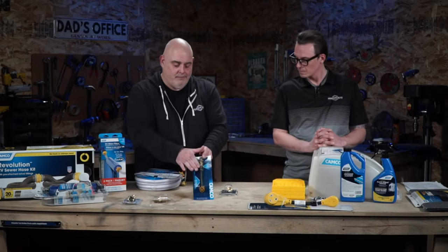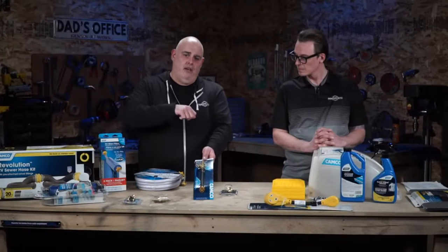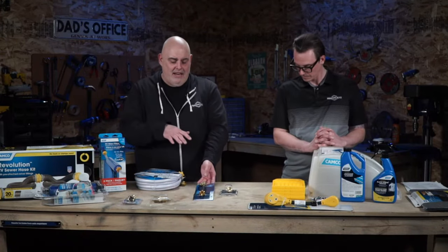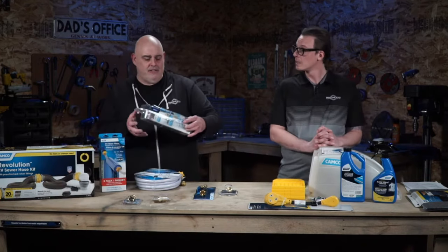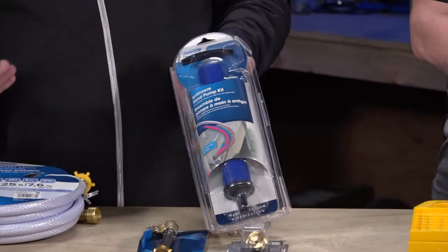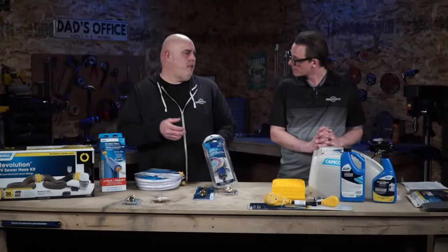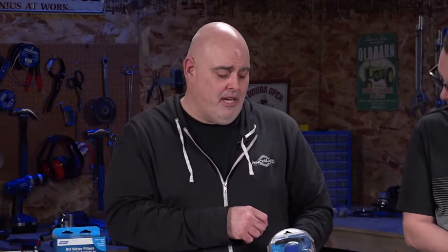And this guy has a flexible hose on it and a ball valve. So you can turn it off, you don't have to run outside, turn the compressor back on, and you can have somebody cycling it off and on, or if you want to leave it charged. The benefit to that is it's going to purge as much of the water out, and then you're going to come up after with some RV antifreeze, and basically it's a hand pump, a transfer pump, so it's going to siphon out of the jug of RV antifreeze, and as you push it back down, it's going to pump it in through the system. Again you'll go circuit to circuit throughout the system, and make sure that everything is running either pink or orange depending on the type of antifreeze you're using. As long as the water is expelled and the antifreeze is in the lines, there's no chance of having any damage from freezing or cracking in the weather.